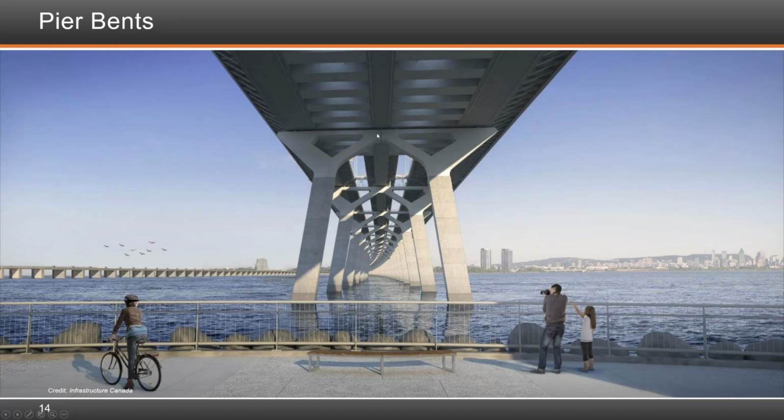The idea is to precast this segment here and bring it into place, and precast this segment here and bring it into place. The weight came out to be prohibitive, 500 tons or so, very difficult to erect into place. So we changed this from concrete to steel. And this was done live after we were awarded the job. We actually turned around with the contractor, worked very quickly to design this and change it from concrete to steel.